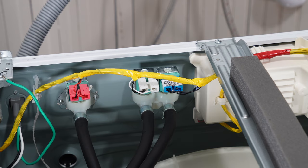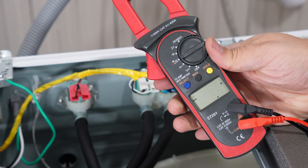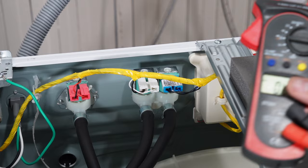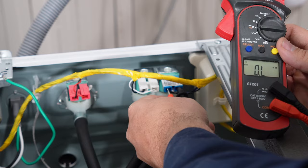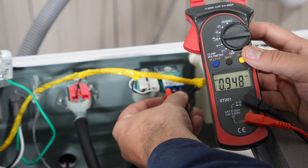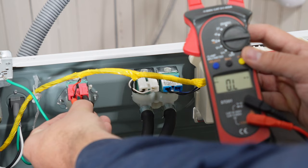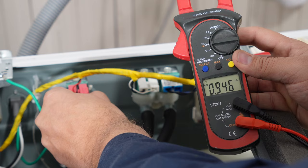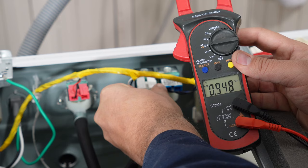Always be careful that they are firmly seated in place. Assuming that they are, take a multimeter and set it to ohms resistance. You can press the leads into each of the wire harnesses to get a reading. Each valve should get the same ohm resistance — in this case we're getting right around 950. It could vary between 500 and 1500 ohms depending on your style of water valve. If you get a reading well outside of that range, take the harness off and test the bare metal. If the number persists or you get an OL signal, it means the valve is damaged and needs to be replaced. I will have a link in the description so you can buy them, or get the kind that matches your model number.